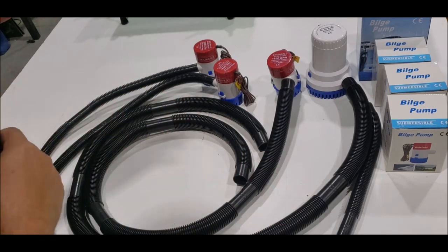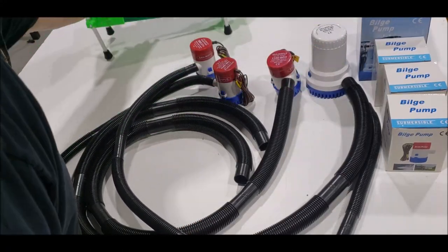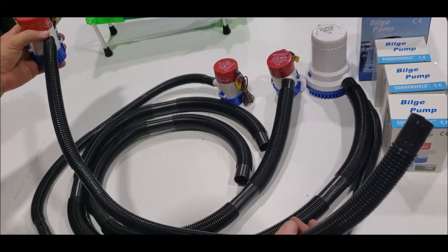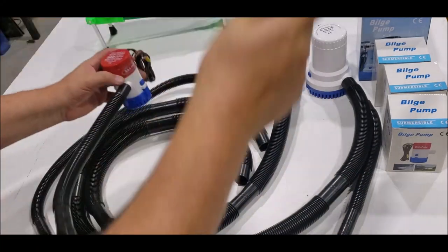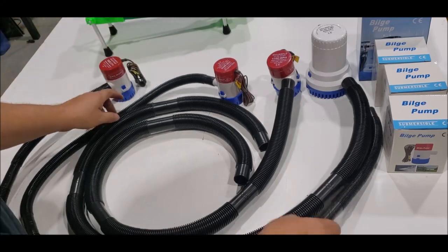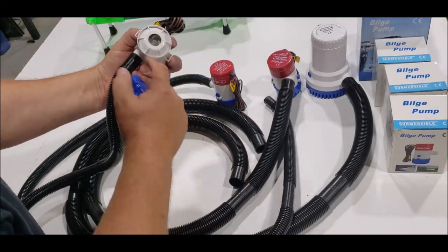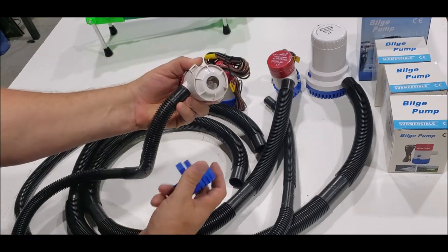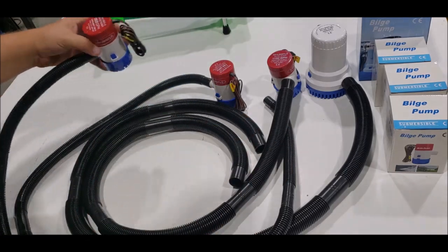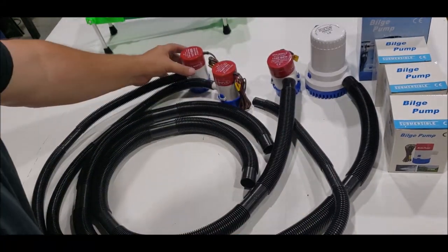This will be a nice little video I'm going to refer people to a lot. With our micro banker and our little cleanup sluice, that thing will run off a 500 pump with three foot of hose — no problem. Three foot meaning vertical height too. But if you were to hook a five foot hose up to that 500 pump, this has an open impeller — it doesn't build pressure and it can't push head pressure up the line. That's what head pressure is.